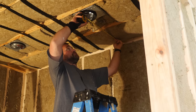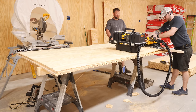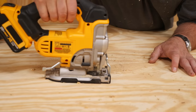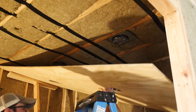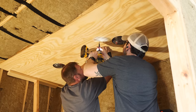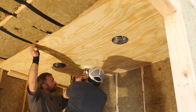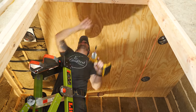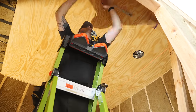With the shop plywood finished, we moved on to the plywood walls in the office. The first boards to get installed were on the ceiling, which we needed to trim about three and a half inches off since the office has an interior depth of eight feet minus the width of the studs. Justin cut out the holes for the can lights, and then we could get the first ceiling panel installed. Justin made a pair of dead man supports out of leftover 2x4s — we would lift the panel onto one dead man, then lift the other end using the other dead man, wedged against the floor for hands-free support. I used an 8-inch screw spacing on the ceiling, as the last thing I want is the ceiling coming down on top of me.